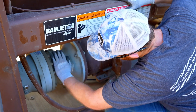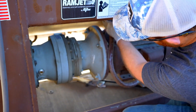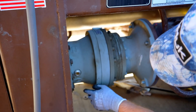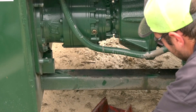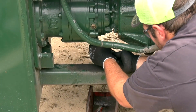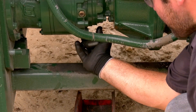Step 7: check on and around gearboxes for leaks. Next, check the oil and oil level in the planetary gearbox. The oil should be translucent and the proper level should be at the bottom of the sight gauge. If not, change the oil as needed. If an oil change is necessary, place a catch pan under the gearbox and remove the bottom plug using a hex wrench. Once the oil is drained, replace the plug and fill it with oil.